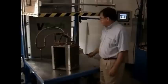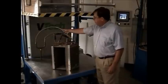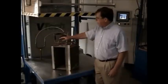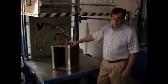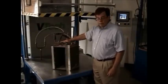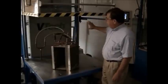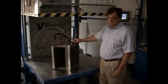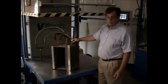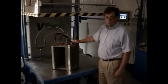The principle of operation is such that we attach the unit with the quick disconnect fittings to these test hoses. These test hoses are connected to two vacuum pumps through vacuum valves. We draw a vacuum on the inside circuit of the unit. During the vacuum test, we perform a vacuum pressure rise test to ensure that the system has integrity before helium testing to the mass spectrometer.